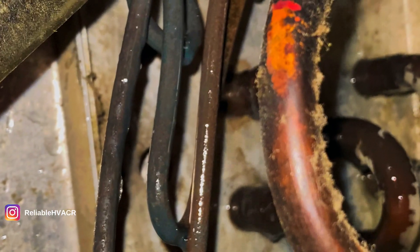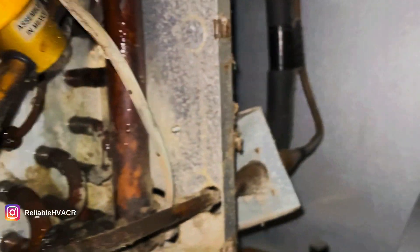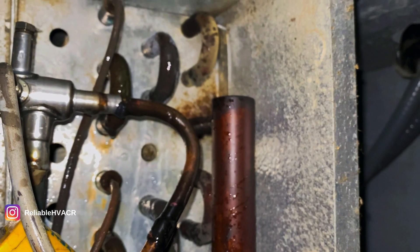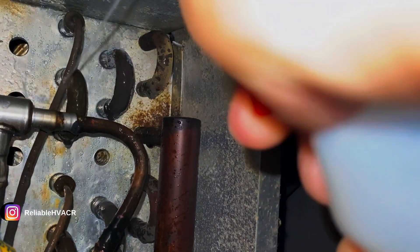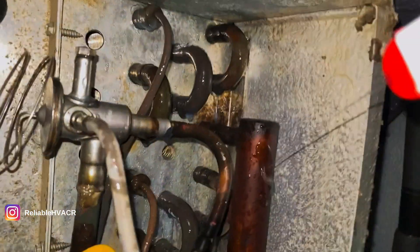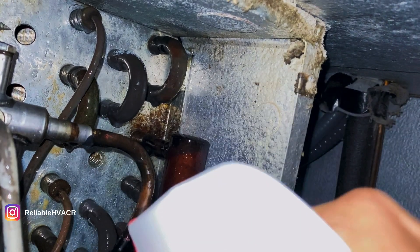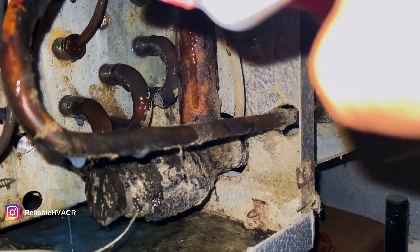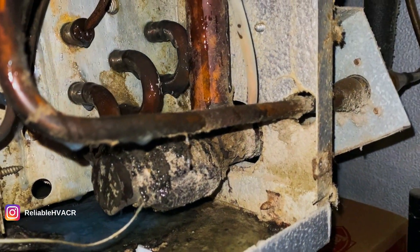It seems to me that we found why we're low on refrigerant here — we're going to have several micro-leaks. Now keep in mind I could repair all of these leaks, but the TXV is not copper-to-copper so I didn't have any special rods to do that one when I had this call, so I didn't bother. The TXV joint is leaking, and we have several leaks on these U-bends. I didn't even check the other side — the coil in the back — all the fins are in rough shape.